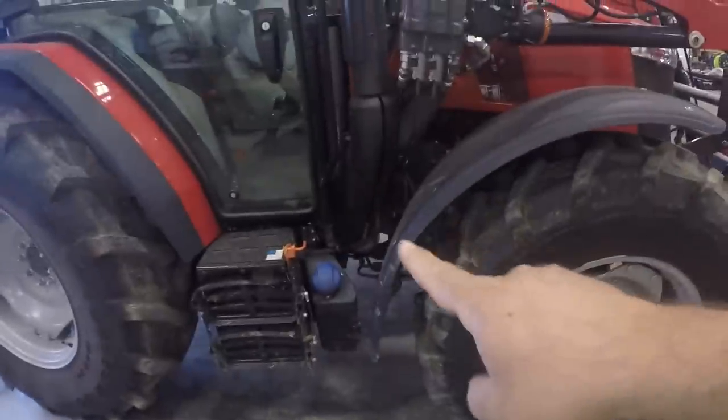And you're like, well, the air isn't very cold. So the way to overcome that, turn that valve off right there. When it's hot weather, just turn it off, and then you know for sure that everything coming out of your vents is just air conditioned. There's no heat influence to it. Most of the time you'll find that you'll get colder air by doing that.